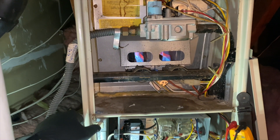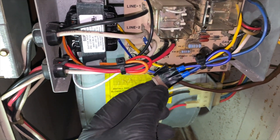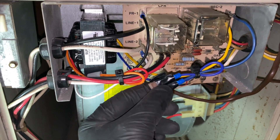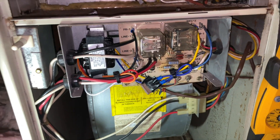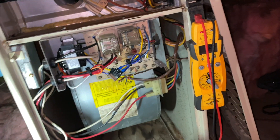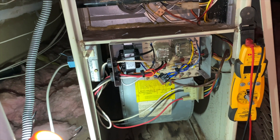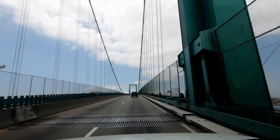We're going to watch it for a little bit to make sure it's okay. 1988 Day and Night — she's all wired up. We put in a 5-amp fuse: just put two female spade connectors and put it on the prongs, wrapped with tape so it doesn't short against anything, then zip-tied everything back together. Put the fan call wire back on. All we've got to do now is put the panel on and test everything from the thermostat and call it a day. Thanks for watching — make sure you like and subscribe, hit that bell notification, tell me what a horrible technician I am in the comments, and we'll see you on the next one!